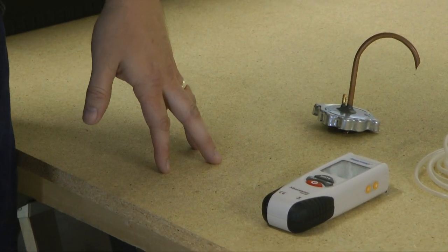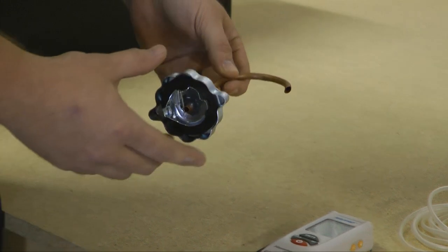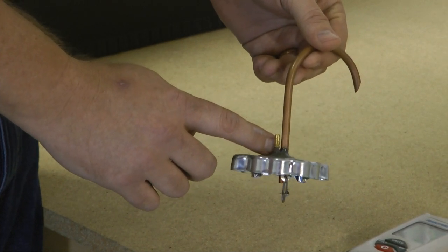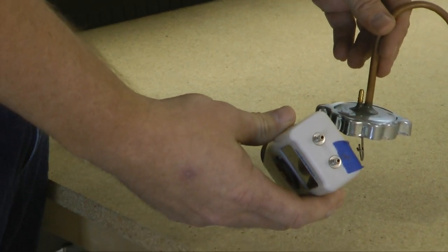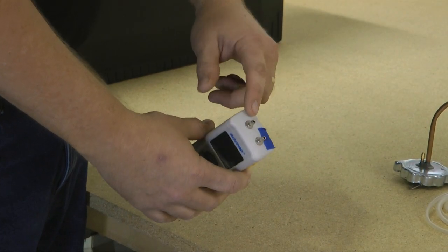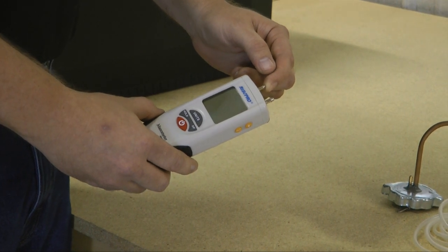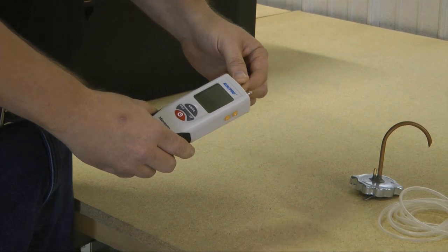How I chose to hook it into my aircraft to verify my fuel venting during troubleshooting was to build a second fuel cap with my fuel vent tube that sits on top of the cap, with an additional brass fitting to hook the manometer up to. The positive port on the manometer goes to the fuel pressure cap outlet, and the negative — which, unfortunately, is not marked on the unit, so check your directions — I decided to plumb into the static port of the aircraft, so I didn't get errors induced by the slipstream in the cabin.